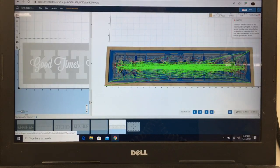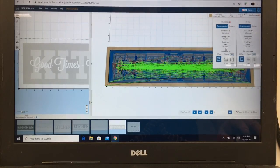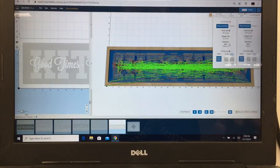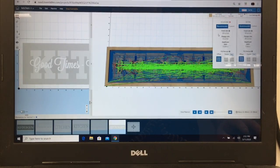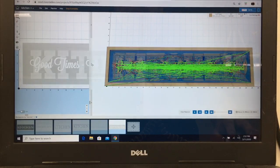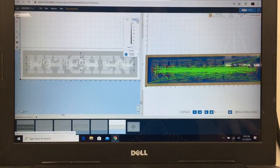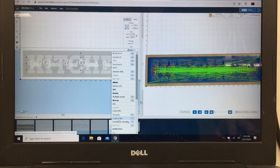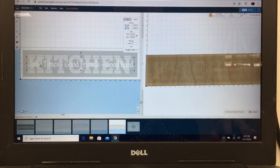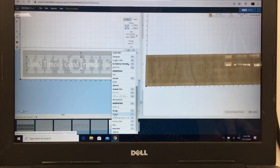Is there another way you can speed it up? Certainly. You can go up to the cut settings and change the feed rates and the depth of cut on both the roughing pass and the detail pass — this strictly depends on your machine. If you're able to do that I would increase these speeds quite a bit based on what my machine can do, but you have to make that decision on your own. One other thing you can do is look at the different fonts — just click on the font itself and change it to get an idea of what it's going to look like instantly. It's an amazing tool.